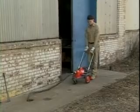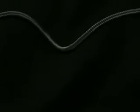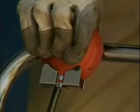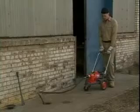The cable must turn freely. If it jams, the cable will build up torque, start to buckle, and then in a blink of an eye, twist itself into a series of loops. If your hands are caught in a loop, you risk severe injury. Again, do not force the cable. If the cable begins to buckle or twist, stop by taking your hand off the air pedal.